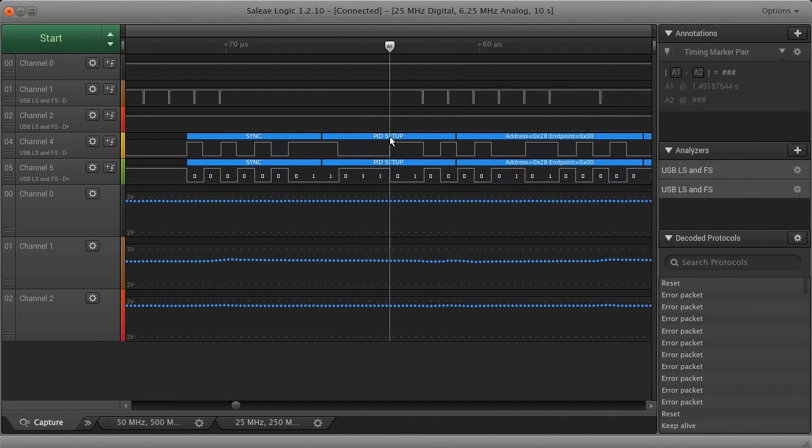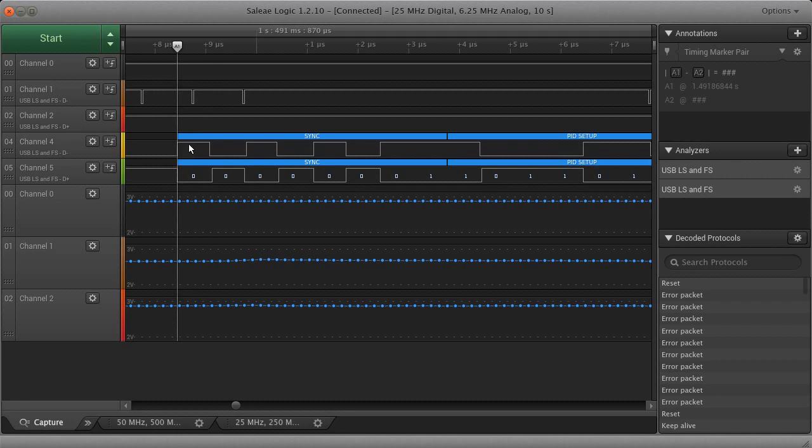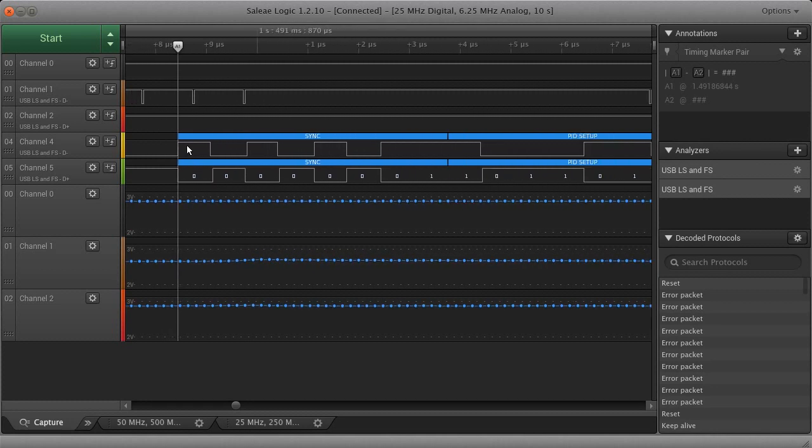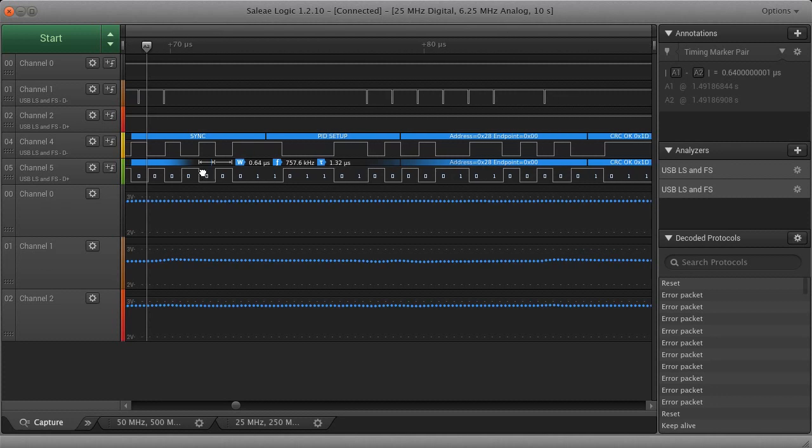Okay. So there's USB 1, and it has both full and low speed modes. Full speed is 12 megabits per second, and I think I can do that with the ESP if Espressif gives me access to the NMI and enough IRAM to actually do this with it. But for right now, I'm just going to attack low speed, which is what the VUSB software stack did on an AVR, entirely in software. And low speed is 1.5 megabits per second. So between these two peaks here, it's about 0.66 microseconds.